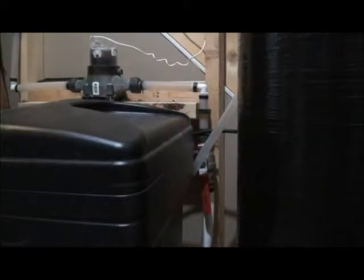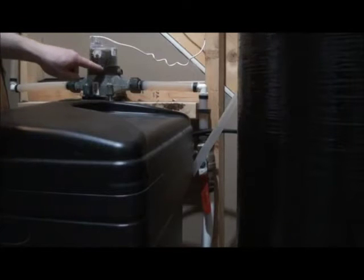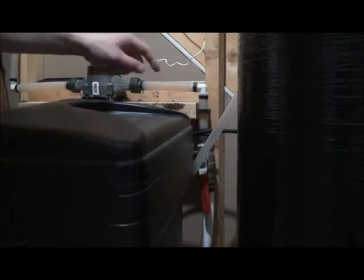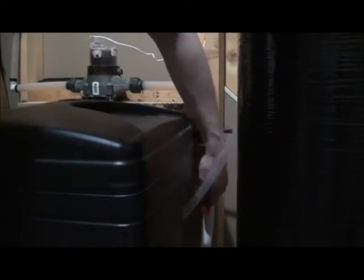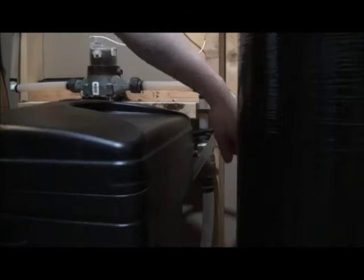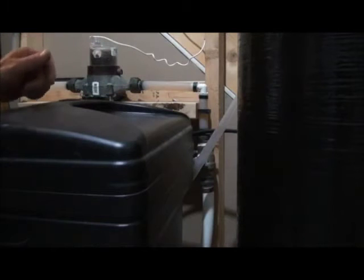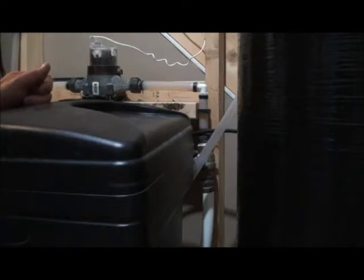All right, step one in this whole process is going to be to shut down the main water supply line. So it's fairly simple. Here you see the meter coming into your house. If you don't know where the water supply line is, typically it's going to feed into the meter here. So if we just go down this valve right here, and just turn it so it's 100% 90 degrees, and that's in the off. The feed coming in will probably be through the ground in the basement and going directly to the water meter first stop, so it's usually fairly easy to find.